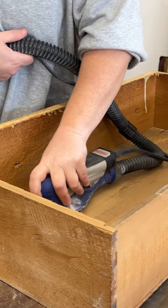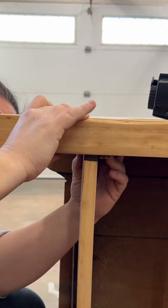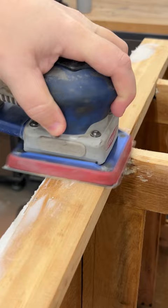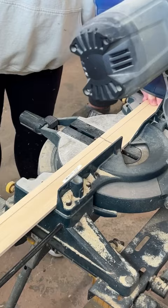Then I re-secured the disconnected frame with a few new nails and used a heavy-duty wood filler to reshape the smashed-up legs. And as much as I loved the original leafy drawer designs, they'd been completely destroyed by someone else's sanding job, so I opted to cover them with a few new strips of wood casing.